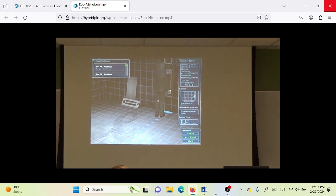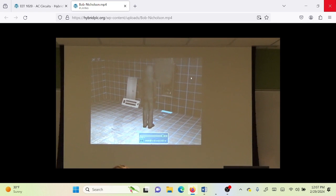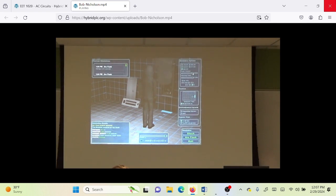Now, this clothing is going to withstand it. I'm going to take it all the way up to 60,000 amps for 2 seconds. The clothing will take up to 40 calories of energy, which we'll see in a minute, and then the clothing is going to fail too. There is no permanent solution to the clothing.